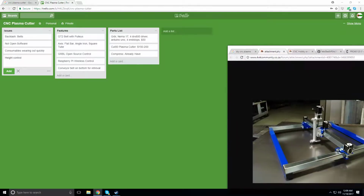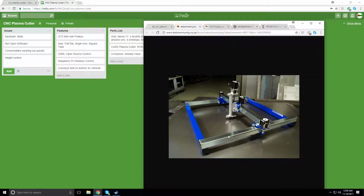And then I'll show you guys some CNC parts. So CNC router parts. So you see here, nice. And then this is all polished, which I'd probably do just to lower the friction on the wheels and also get rid of any sort of vibration as it goes over, because most likely I'm going to be getting this at the local Sims Metals, as my dad used to work with them, so I get good deals from there. So this is going to be A36, and A36 has got kind of that weird surface, so most of this will probably be gone over.